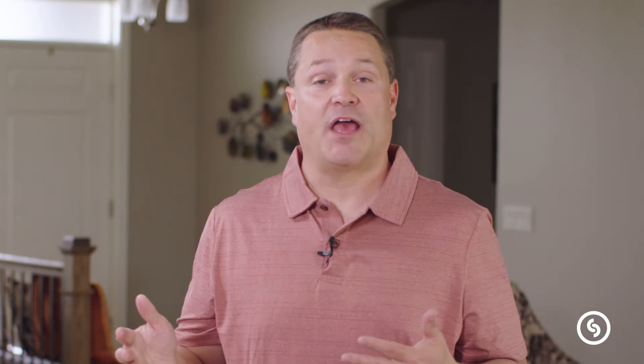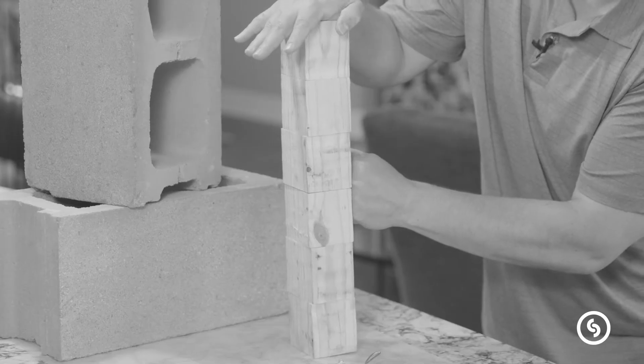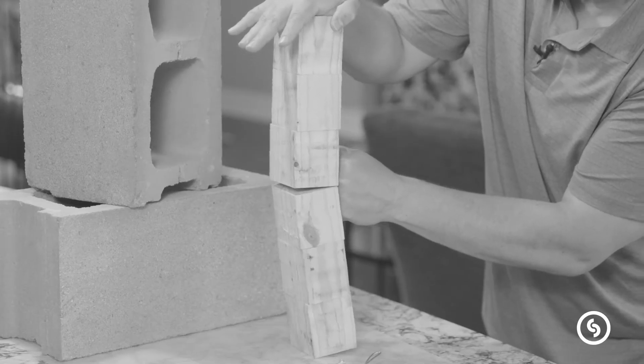It will actually just show its signs of distress in a different way. You may have seen when we did an experiment about block walls where we talked about the shape of a distressed block wall forming the shape of a belly — we say that it has a bowed shape. But a poured concrete wall doesn't usually take that shape.